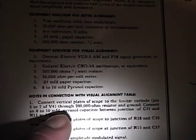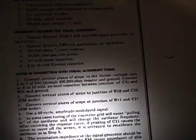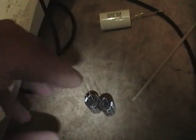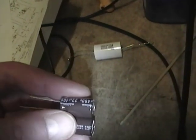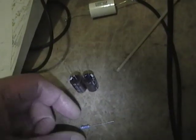The instructions specify a pyranol capacitor. I had to look that up — a pyranol capacitor is a non-polarized oil-filled capacitor that tends to contain PCBs. The biggest non-polarized cap I could find is one microfarad, so I'll use an old trick: take two polarized electrolytic capacitors and connect the two positive leads together, then use the two negative leads, which forms a non-polarized capacitor. Connecting capacitors in series cuts capacity in half, so I grabbed two 22s, which gives about 11 microfarads — close enough to 10. I've also got my 200K resistor.